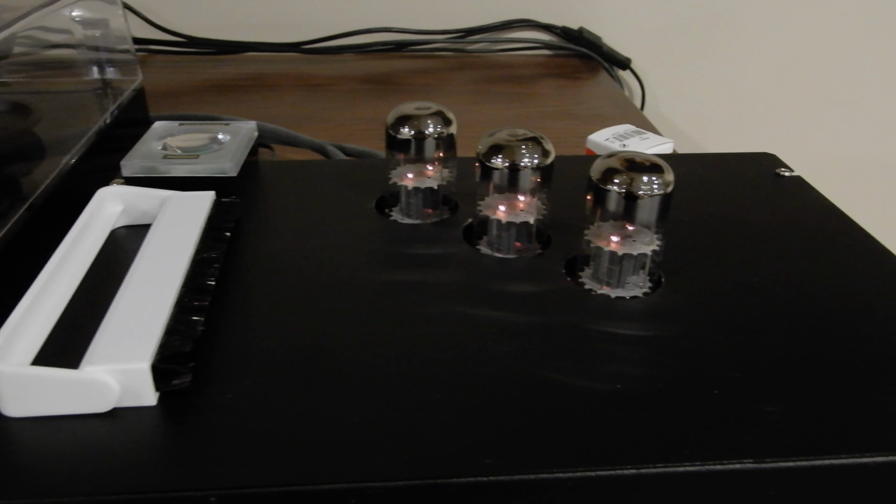Now eventually I swapped out the Emotiva preamp for a Tavish Designs vintage phono preamp. It's not vintage because of the age, that's just the name. Like I said, it uses the 6SL7GT tubes. These are the Tung-Sol tubes for amplifying the moving magnet section. I did it for a couple of reasons. I wanted to hear the tube sound and get the tube experience, but the main reason was I could buy the bare circuit board, and it just seemed like a fun electronics project to assemble. So that was kind of the main reason.